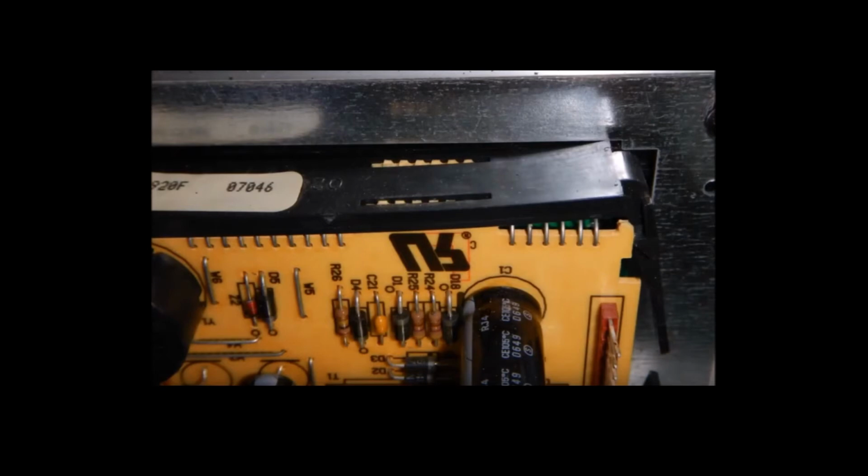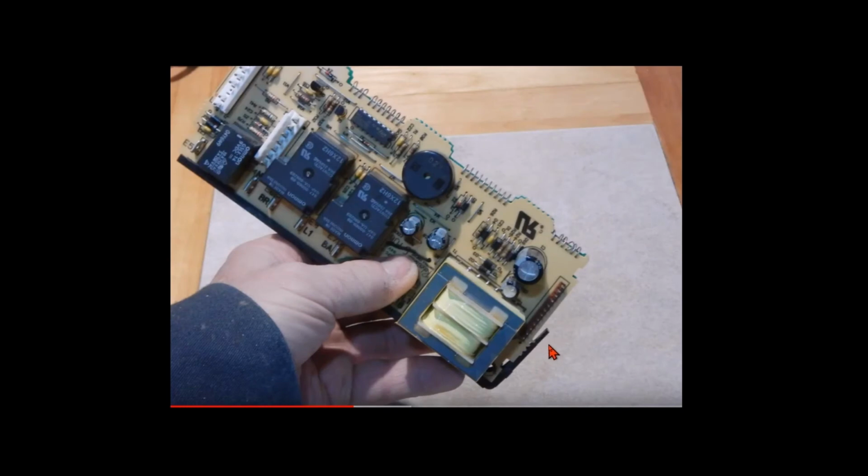After you get the bezel off of the front of the clock screen, you're going to want to get the circuit boards out of the carrier, so out of their enclosure. This is not our exact board, but this is how it's done. You see this little tab here? There are 4 of these levers, and you pull this tab up to be able to release this little triangular piece from this notch. When you pull that lever up, you're able to peel this plastic surround off of the circuit boards. There are 2 of these, one covering this half, and another one covering the lower half. That's how you get to the circuit boards. And once you've done that, you'll be able to just gently open the two circuit boards. Here's another view of it. Here's the lever you want to move.